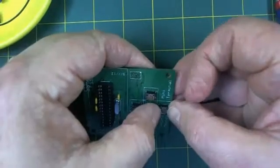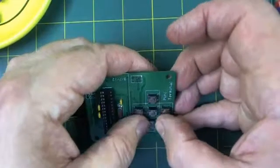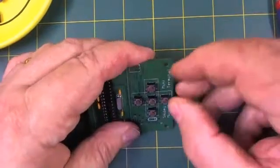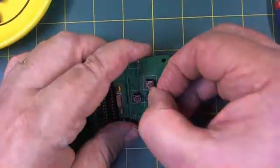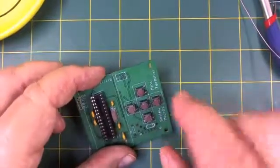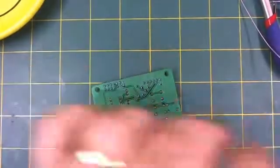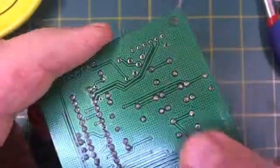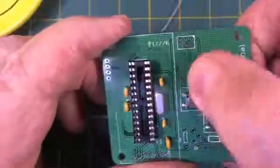Use your fingernails to push each button in a little bit and press them down — make sure they're snug and square. It's possible to solder these when they're a little off-centered; it won't affect the way it works, but it will affect the way they look. Once the push buttons are flat, they'll stay on when you turn it over, and then solder each of the pins. Once soldered, inspect them and make sure you don't have any solder bridges between the closer pins. And that's your buttons.